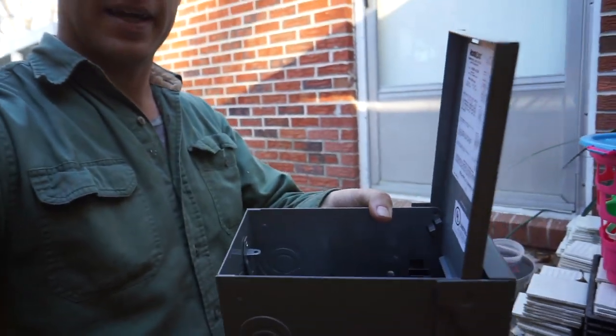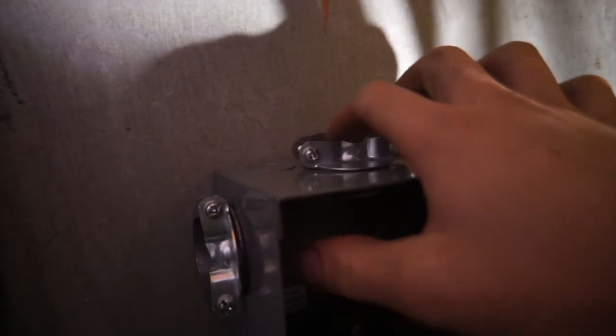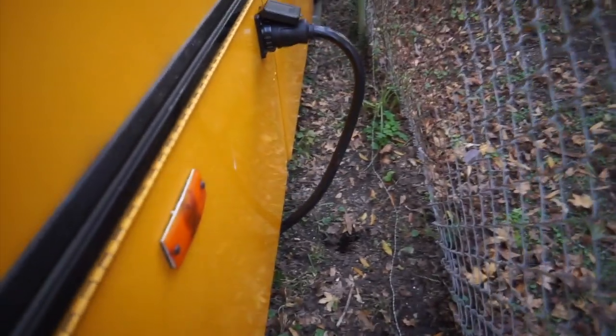I need to find a good location for my 50 amp main breaker, and then we're going to create our cable attached to the inlet to the box — that's the next step. I got my main breaker mounted and knocked out the knockouts, and I got my wire clamps in. I actually took it outside to do that because it was a pain. Now I've got to make a wire that goes from in here through into my marine shore inlet, which I had to take out. And would you look at that — my shore power line is connected. It doesn't have power yet, so let's get back to work.